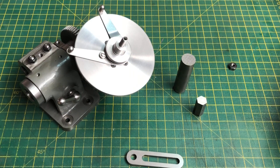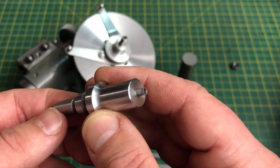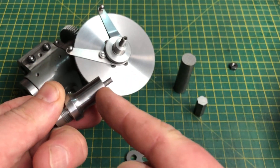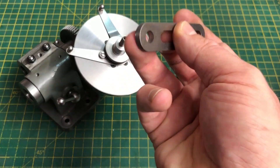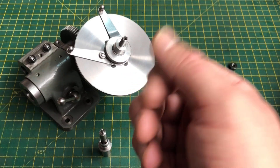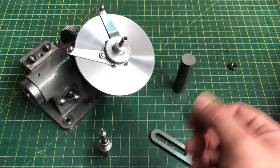So let's take these over to the bench to have a look. The plunger fits into the body quite nicely — I can't feel any play and there is no binding. However, there is still quite a bit of work to do on this assembly before it's complete. I need to make the handle that will hold the plunger in place, mill some grooves into the body, and some flats onto the screwed boss to accept the arm. The arm itself needs boring and threading to take the body, and there is a nut to be made to hold the whole thing together — too much, in fact, to squeeze into this video. So we'll finish this off in a short video next time. Please do leave any thoughts in the comments, if you want to see more like this please do subscribe, and hopefully I'll see you again. Cheerio!